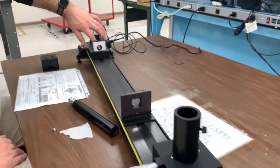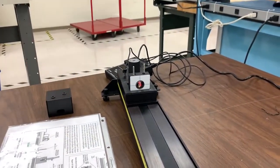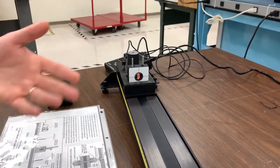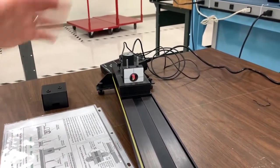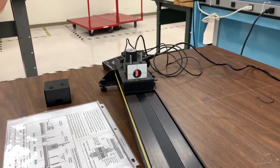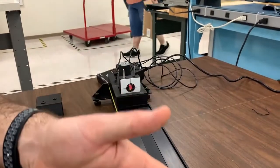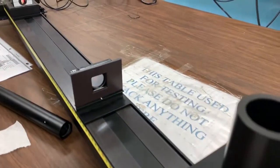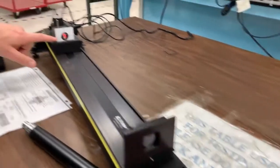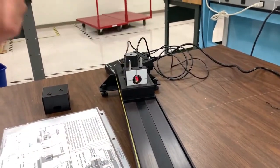Adjust the flywheel so the back of the mirror is facing out. I do this as a precautionary measure because as you align it, there is a laser beam in play here — if the mirror was rotated improperly, the beam can go stray and hit someone in the eye, and we don't want to do that. Align the laser beam so it does its best to go through the centers of the two lenses, and most importantly, land right in the center of that mirror that's rotated backward.